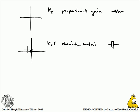And what DC gain you want to eventually track your input? You want to track your input. Right? So what this says when you have no DC gain is I say, okay, I'm going to inject R, something I want you to track, all right? And it says, hey, I'm going to wiggle when this is wiggling, but when you stop here, instead of going here, my system is actually going to do some tracking response and then go to 0. Right? But I didn't necessarily want it to go to 0. I wanted it to go to that input. Right? I want to track my input. I can't track my input here. Right? So it's essentially a high frequency coupling.